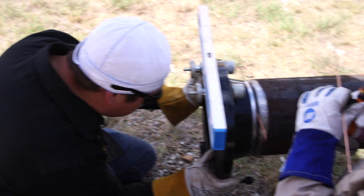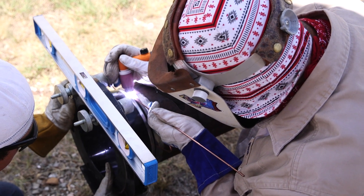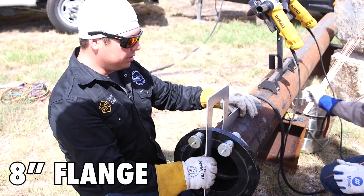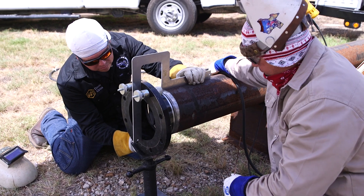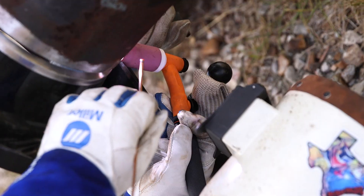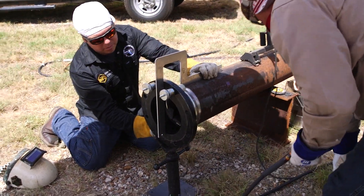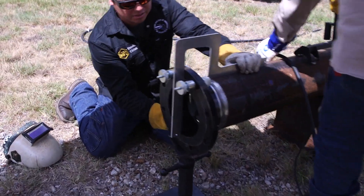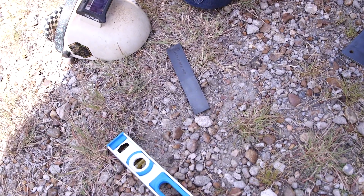Pretty good right there, Andy? Yep, give it a tack. Go ahead and put a tack on top. Now that we got the top tack in, we got the flange to hold. I'm gonna go ahead and square this 8-inch flange. I'm gonna use this wedge just to keep it from closing up on us. Go ahead and tack on the bottom. I usually like leaving the wedge in there a little bit — the tack has a tendency to basically close up, it's gonna try to squeeze the bevel in. You can see my wedge is already kind of stuck. Just let it cool, then remove the wedge. Now I'm gonna remove these two hole pins out of our way.